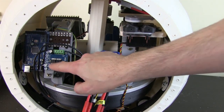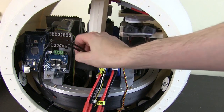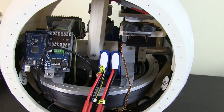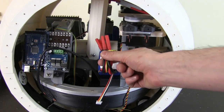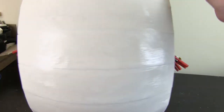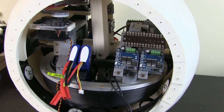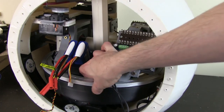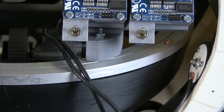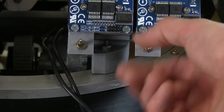On the other side we've got an Arduino Mega, another motor driver — the BTS 7960 — and the wires conveniently come out for the main drive motor. Two more batteries and another power strip. These batteries are wired in parallel to give 12 volts, then further regulation takes that down to five and six volts for the servos. On the other side, those batteries are wired in series to give 24 volts to drive the main drive motor, side-to-side motor, and the flywheel motor which isn't fitted yet. Since last time I've fitted some little enable switches for each motor driver so I can switch them on and off independently.